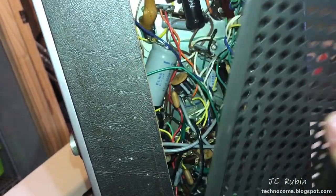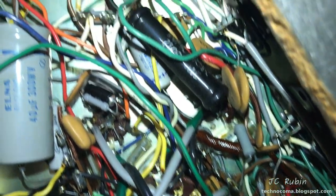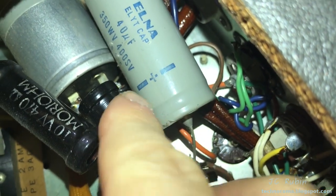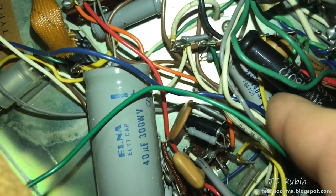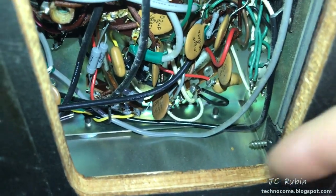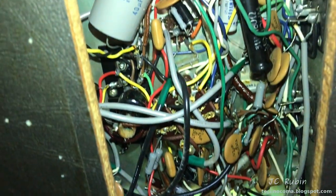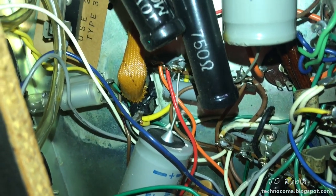Finally got that off — let's take a look. Oh, that's not too bad at all! We'll get in there and take stock of the capacitors. There are a couple of big ones in here — big for back then. I don't have to worry about getting shocked; this thing hasn't been on in years. I've got 40µF by 350V, 40µF by 300V, and another little one back there. We'll write a list, place an order, and clean up.